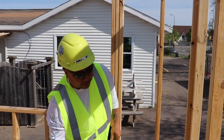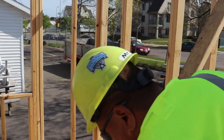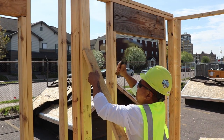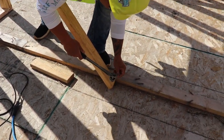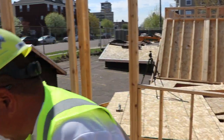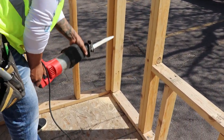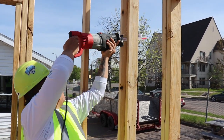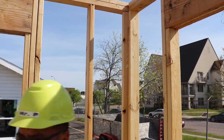Let me pop this out a little bit and pull that last nail out. I want to make sure this wall does not fall on top of me or anybody else. So we've got to brace this up again just to be safe. I've got one nail each top and bottom. Now I'm going to pull back and cut the rest. There's one nail on the very top — try not to kill yourself, grab a ladder.